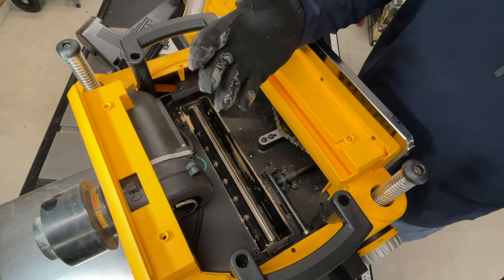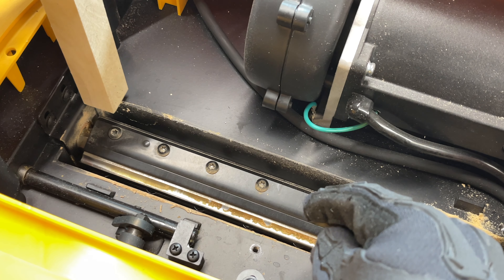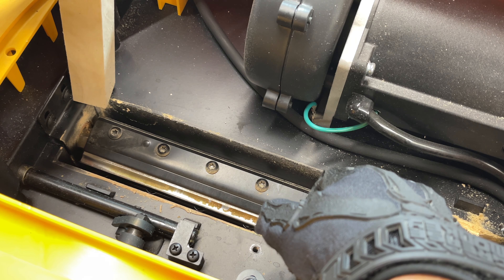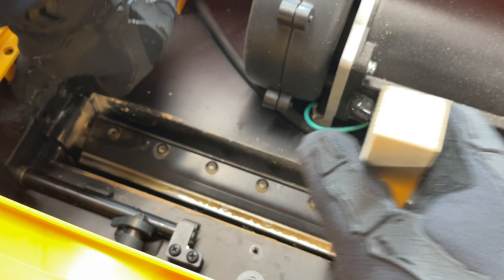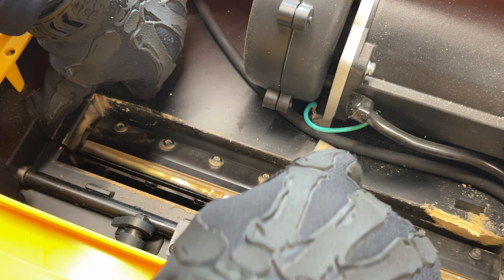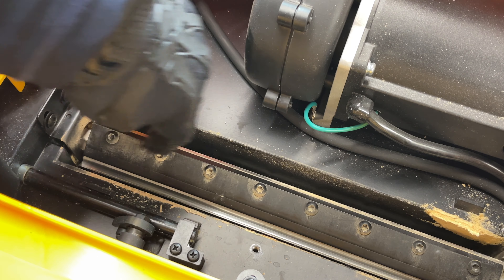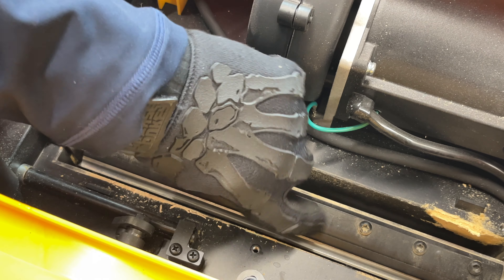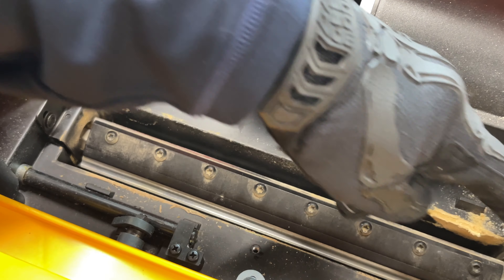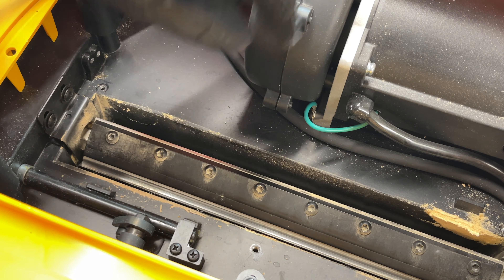Please wear gloves and be really careful, because it's basically a giant razor blade on both sides. The cutter head has a release bracket on the side — you push it down and it allows you to rotate the cutter head. They suggest a scrap piece of wood to do this; I couldn't agree more. You don't want to get your hand anywhere near this thing because it's sharp. There are three blades, so you're going to do all eight screws, take the bracket off, flip the blade around, make sure it's aligned, put all eight screws back in, and then rotate the cutter head two more times and keep doing it until all the blades have been flipped.